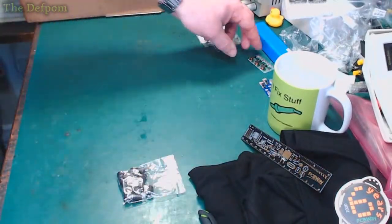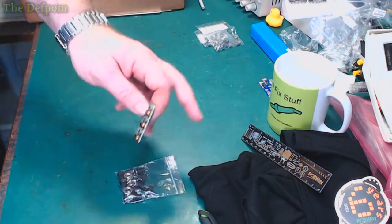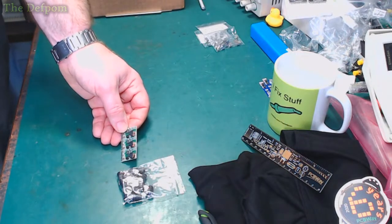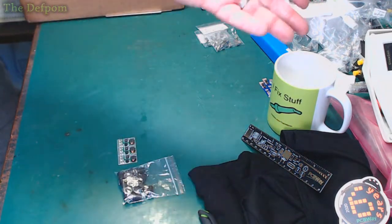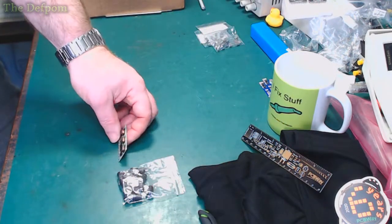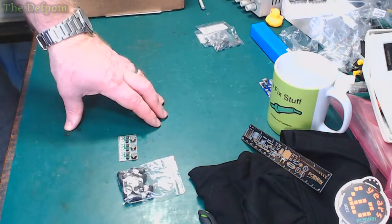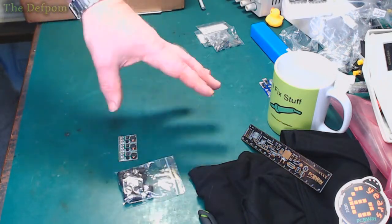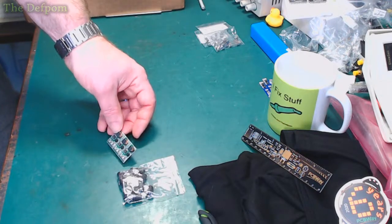I'll bet you there's my spare ones actually. Actually, I think I've got these as potential ones to use in there, because it only actually needs 9 volts, because the batteries it's running on uses 2 18650s in series, and it's also got a BMS in there as well. So that actually floats up the negative side of the batteries to make sure they're set the correct voltage. So fully charging those, you want about 8.7 volts or so when it's fully charging. So this can do 9 volts.